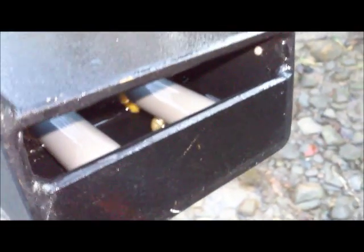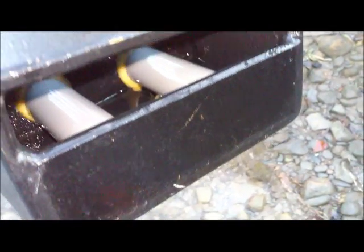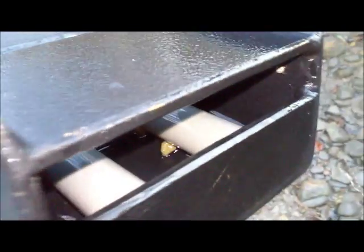The reason being is that water comes in down through here into those tubes. These tubes have holes in them, and the water coming in is creating some water pressure down in there, and they spray out because they're spray tubes. That fluidizes the bed and moves the material around. We get the lighter stuff coming up and over the edge, and the heavier sitting at the bottom.